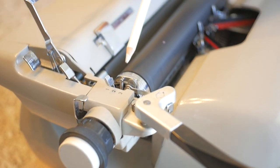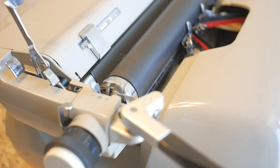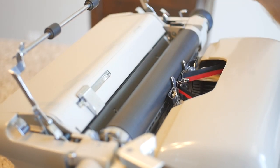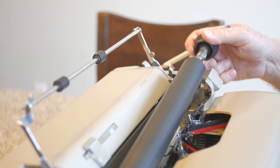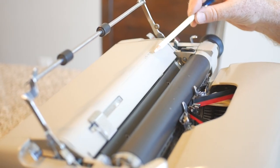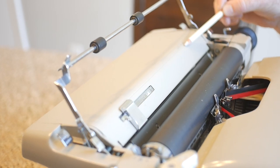It's unique in that this longest mark means you have eight lines left, the next means six, then four, then two, and then you're at the very end of the paper. The platen itself is an 11-inch model, which goes with the serial number — it has '11' as a prefix to the serial number. Also like a Smith Corona, you can easily pop the platen in and out and exchange it for a different hardness, depending on whether you want to do stencils or replace a hard aged platen. Right above that is the line meter, where you set the end of your piece of paper as you adjust your line indicator so it will tell you the end of any size of paper, because you start at the bottom for your adjustment.